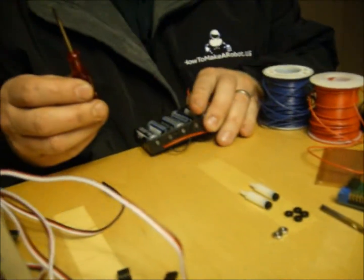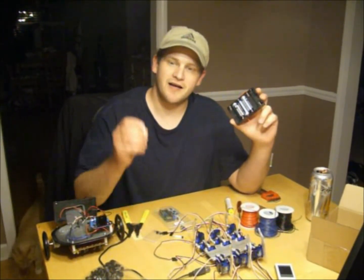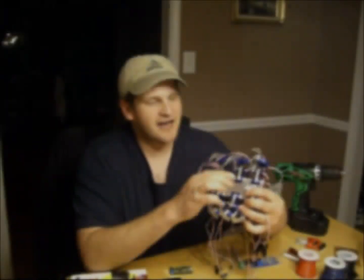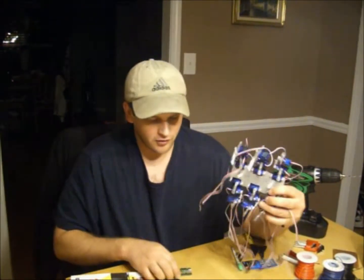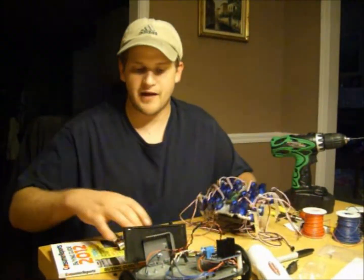Battery holder and screwdriver. We're going to now mount the battery pack to the bottom of the hexapod robot using two standoffs. I've mounted two standoffs to the battery pack. We've drilled two holes for mounting the controller on top. Now that we have our controller and battery pack mounted to the chassis of the hexapod robot,